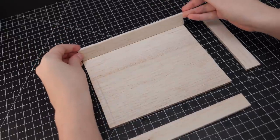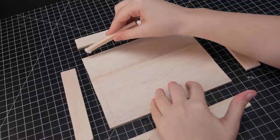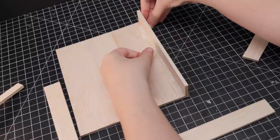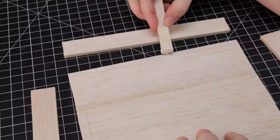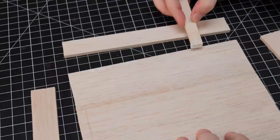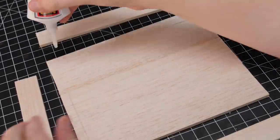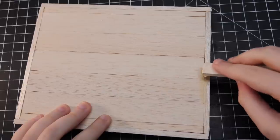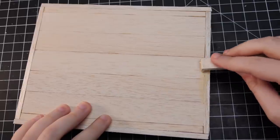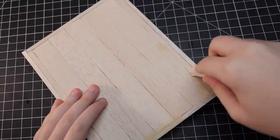I made the sides one inch tall again but this time I glued them on top of the piece I just made because I wanted the top piece to look seamless. A quick side note: for the entire project I used both wood glue for a stronger, longer lasting bond and super glue for immediate grab so I could keep working without waiting for the glue to dry. Inevitably there will be gaps if you're cutting the wood by hand, but nothing a generous amount of wood putty can't fix.